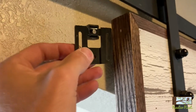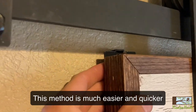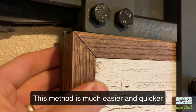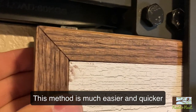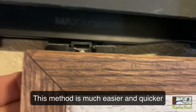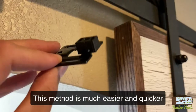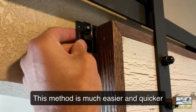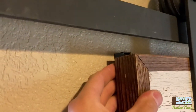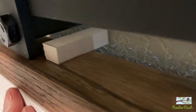As an alternative to making your own stop block, you can use the included block that comes with the soft close mechanism. Instead of screwing it to the top of the door, you screw it to the back side. It just means you need about an inch and a half of clearance above the top of the door opening so you don't see it from the inside. If for some reason you don't have that clearance behind the door, then make your own wood stop block and mount that to the top of the door.